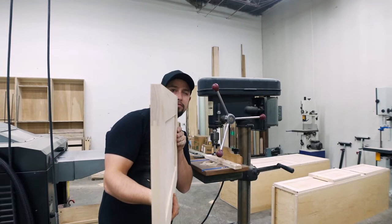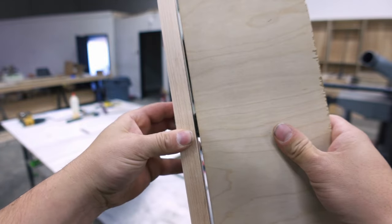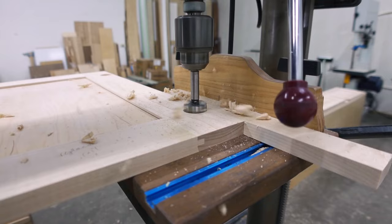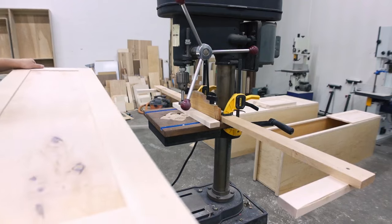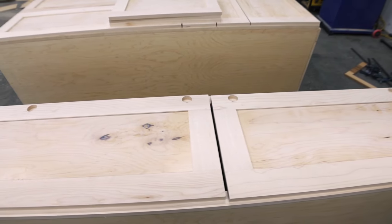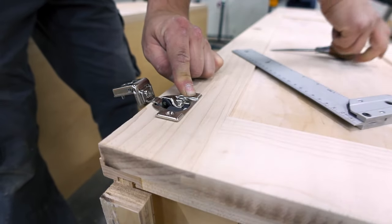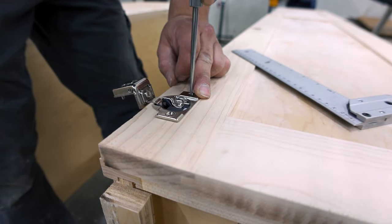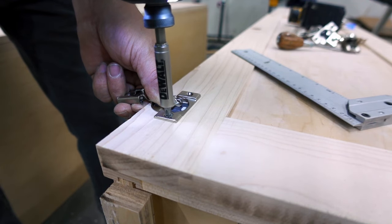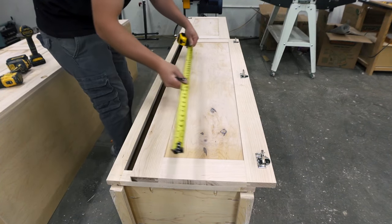Here you can see I'm choosing the least straight side of the door for the hinges to be on. The concealed hinges are commonly 3 to 4 inches from the end. One great way to make sure your hinges will work with the reveal you want is building a test setup — I'm shooting for a 3/16ths reveal for most of the doors. There are several jigs on the market for this drilling process; I prefer the drill press because it's very repeatable and consistent. Don't forget, longer doors may need a center hinge as well. The installation is pretty straightforward — I use a hinge as a guide to mark the hole position. A self-centering drill bit comes in handy here. Using a fairly undersized drill bit, I can pre-drill the holes to a specific depth, then drive the screws. With the door flipped inside out, I can reference where the hinges are located and transfer to the face frame. The 1-inch pocket hole screws work perfectly for mounting the doors.